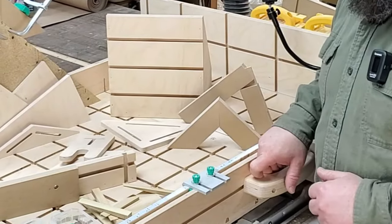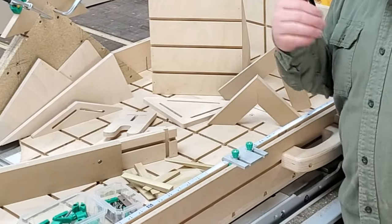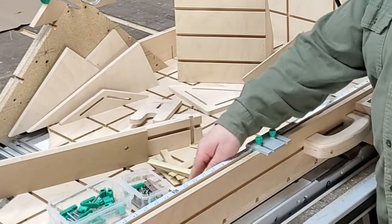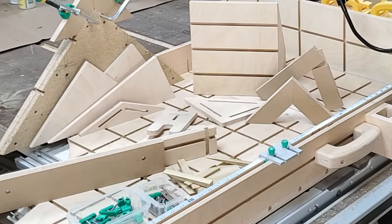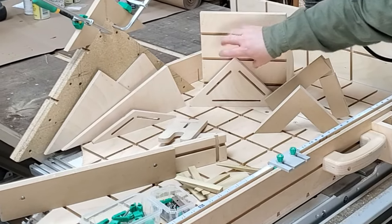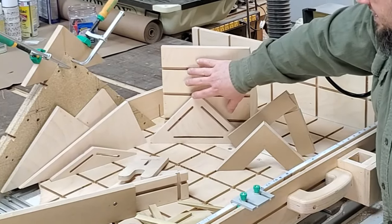It's just that simple. Because I built such a big sled right out of the gate, it has made this thing even more versatile to me, because I can do a lot more with it than I could with a small sled. Also, other little jigs. This is an auxiliary fence slash clamping station. We have other little jigs and fixtures that are designed to be mounted with this. These same angles can be used with this to create custom tapers or custom setups.